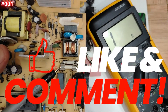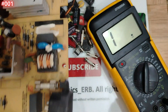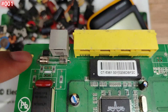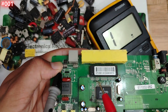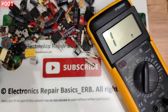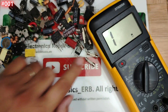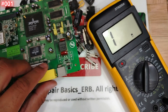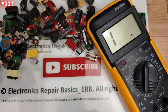If you find this video helpful, please like and share it with friends to help the channel. Now let's check a router motherboard fuse using ohm mode — we get two point six, two point three ohms. Same reading. So we now know the fuse reading is the same whether tested outside the board or directly on it.